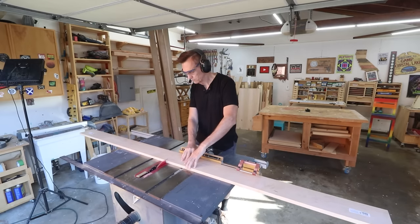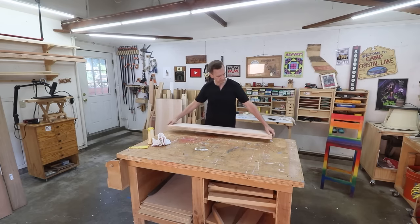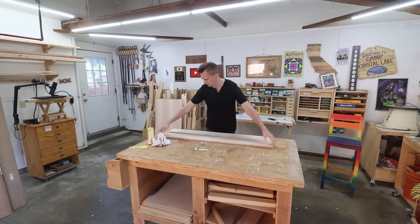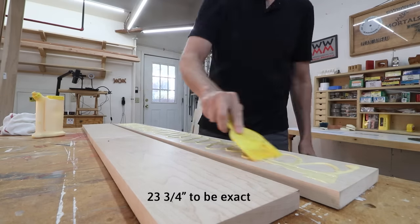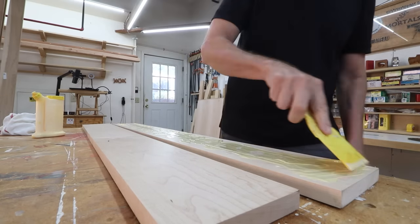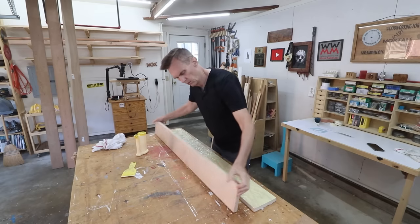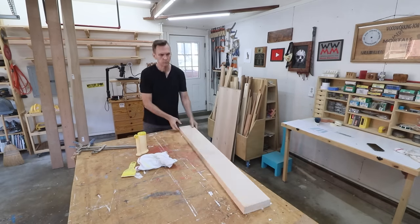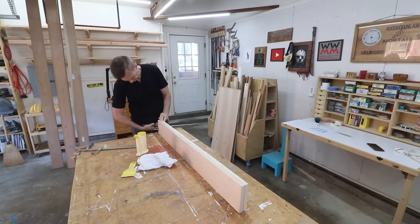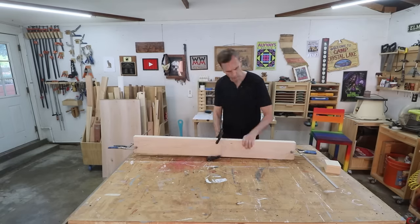So it's going to make the legs a little bit smaller. I'm thinking the legs will be around 23 and a half inches long once I cut this up, and I'm going to have to square them up a little bit after the glue-up. Just something to keep in mind is that kerf of the saw — if you can, it would be good to get a board that's a little bit longer. Unfortunately, this eight-foot-long board was the longest they had at the big orange box center.